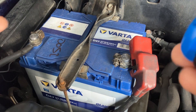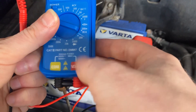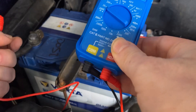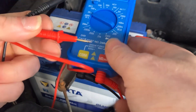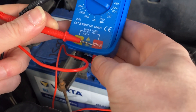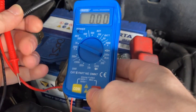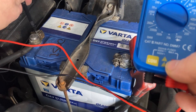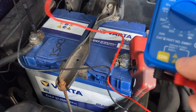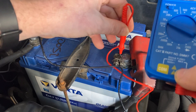You've got two leads here — COM is the black one, which is your earth, just as it is on your battery. Black for common earth, which gets plugged in there. Then your other lead: on this smaller cheap multimeter you've got your volts socket as well. It's set to 20 DC volts — put the negative lead in the COM socket and the positive in the volts socket.